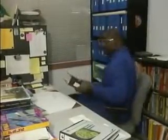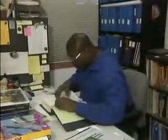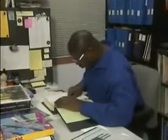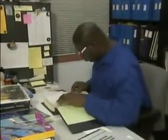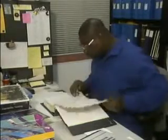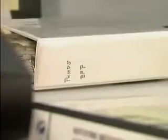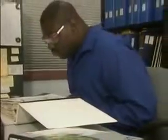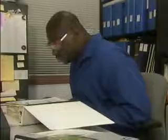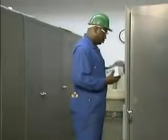A pump overhaul begins the same way that any other type of mechanical maintenance work begins, with careful preparation. A good first step is to check the pump manufacturer's instruction manual to make sure that you're familiar with the pump specifications and any special instructions pertaining to the overhaul. Also, check your company's procedures. It's important to follow those procedures exactly without making any unauthorized changes or taking any shortcuts. In addition, you should follow all applicable safety precautions that are associated with the work.